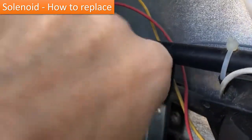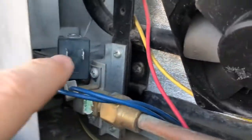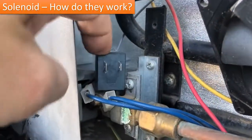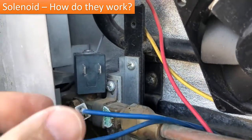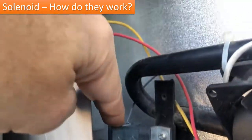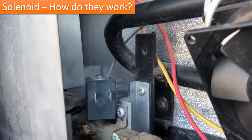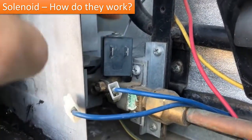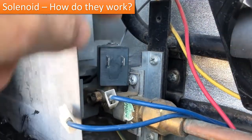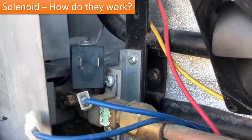Hook up your wires and you're set. For those of you maybe a little nervous about this, let me explain exactly what this solenoid is. Coming out of this gas valve, there is a tube, okay? And you can see the top of it right here. It goes right through the center. That is completely sealed in the gas valve. So if you take this component off, no gas is gonna come out. You haven't exposed anything, because obviously that'd be a safety risk just in manufacturing.